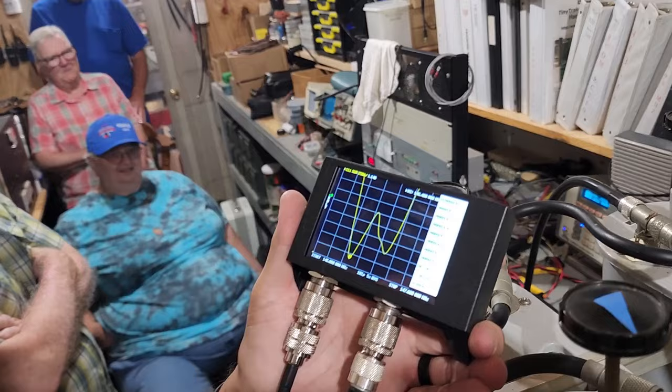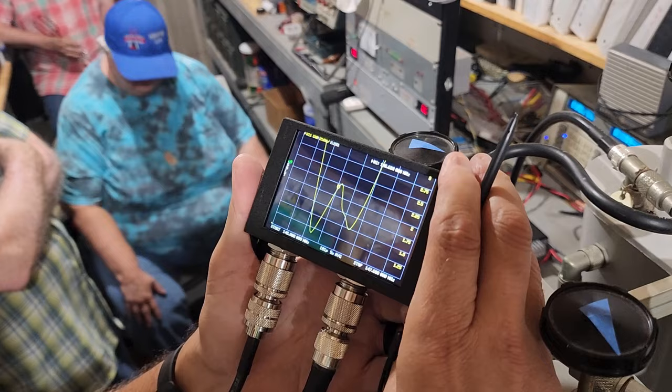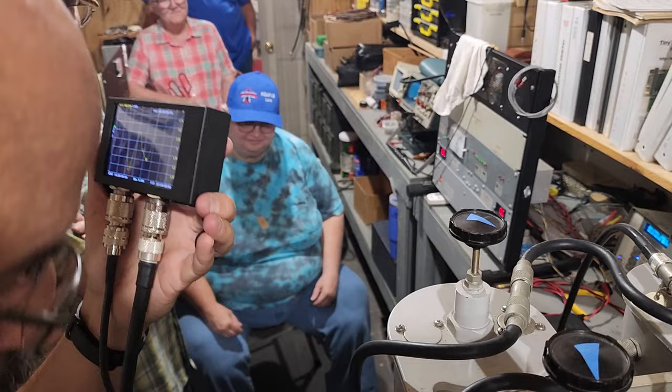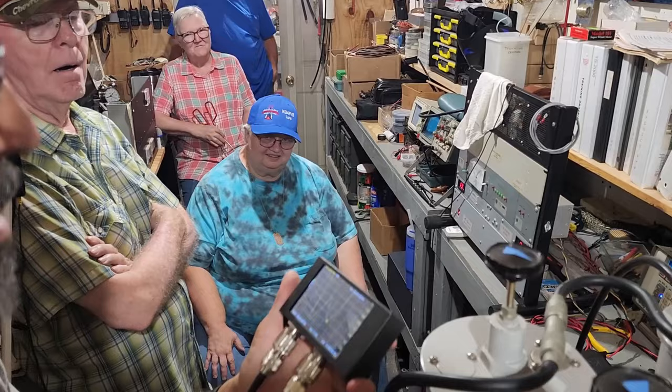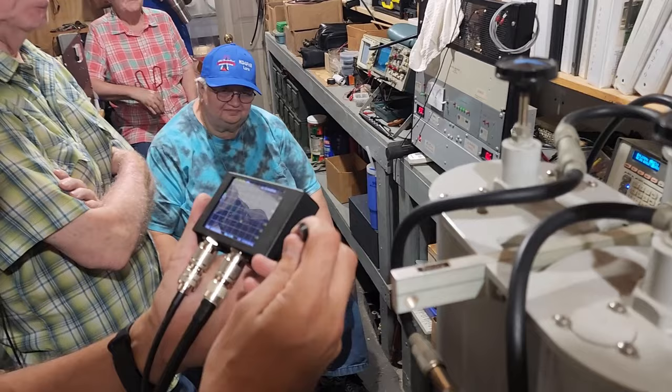It says 146.48. There's 8A — so that's what it's showing. I don't know why that's showing 4A, but because we are connected to this side, which is 2A. It could be it's just not that accurate. I don't think I have this set up right, but we're seeing something. We should see the double dip. So at this point, we're going to go swap out the duplexers.